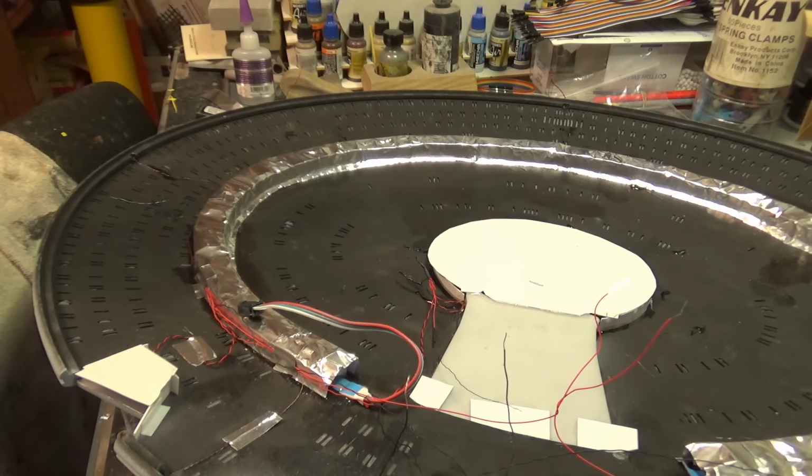So it's going to be a question now of condensing all this and getting it to fit over top of the neck. Now I did have to do some grinding and cutting on that piece of brass that I put in yesterday, and I knew I was going to do that, but I thought it was better to do it in place than to pre-cut it, just because A, now I know exactly how it needs to be cut, and B, I can depend on the full width of it when I was clamping it in place yesterday. Let's go take a look at it.